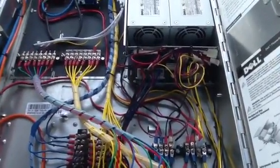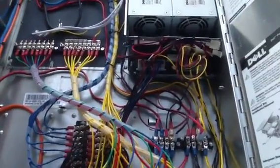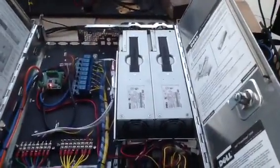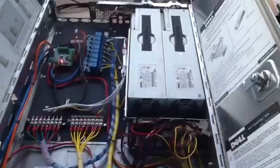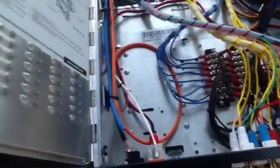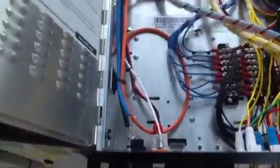There is a positive 12 volts, a positive 5 volts, and ground available within this unit. What's cool is if one of those two power supplies goes out, the other will keep the entire thing running. As far as the input signals go, the DMX comes in through this XLR connector mounted in the front, through the black category wire along the side. The blue wire that comes back out to the panel is simply a loop-through to the connector, which has a terminator — required for DMX protocol.